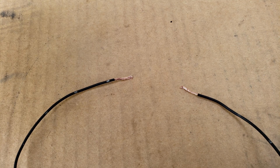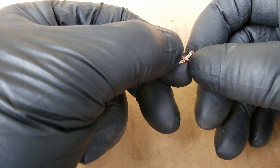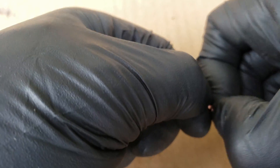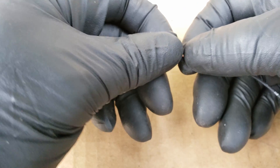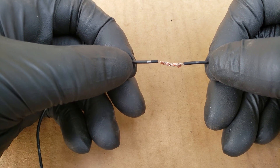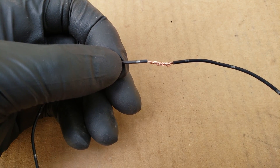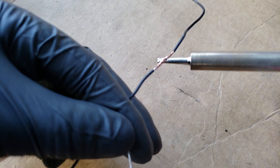As we did earlier, we'll want to twist both wires together. There are many ways to twist wires, but this method works best for me and is easier to do. Cross the wires and twist each side in the opposite direction. The main thing that matters is that the wire strands are intertwined to give a good connection between both ends. The most important part of soldering is that the soldering iron is hot enough, because if it's not, it makes the job a lot harder and more frustrating. Whenever you're soldering, do this in a well-ventilated area, keep away from anything flammable, and don't forget the safety glasses.